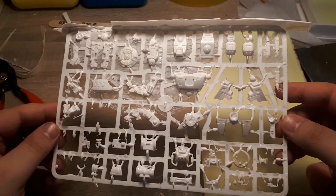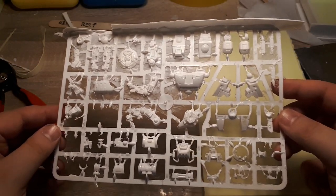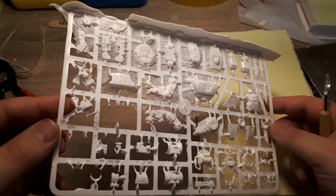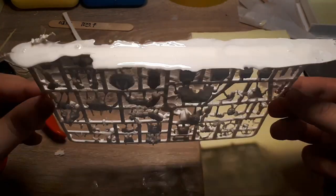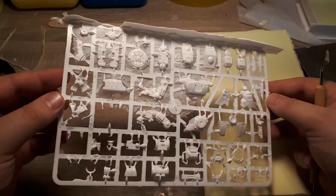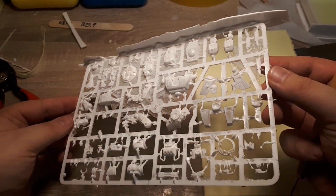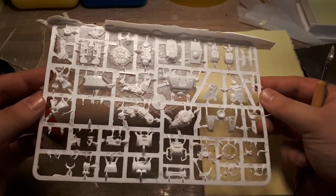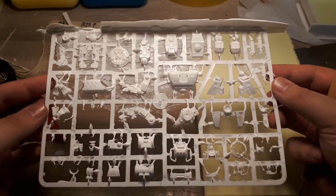It's also worth noting that the liquid plastic I used here is the 15-minute cure time plastic. So, realistically, if we use the 30-minute plastic, 30-minute cure time, I think we're actually going to get much better results, because the liquid plastic has more time in its liquid state to seep into all the crevices and all the corners and fill up all the gaps